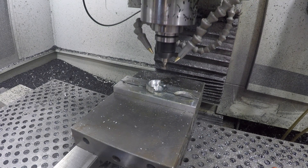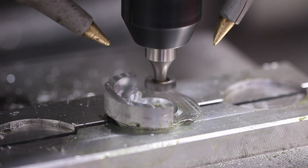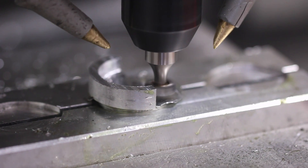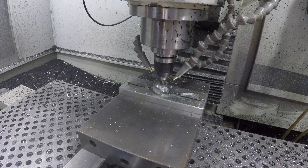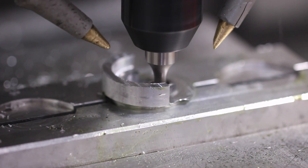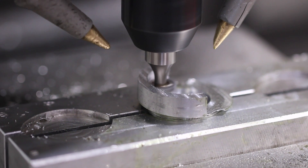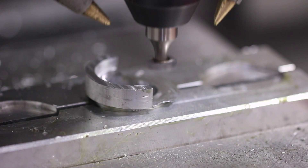Last but not least, the Woodruff groove. There's just always something nerve-wracking about undercutting — no matter how much you do your homework and test it and prep and do gentle lead-ins and widths of cut, undercutting is just nerve-wracking. I used to do a lot of it on another job and we would try to buy staggered tooth to help clear your chips, because that's the real enemy. This looks good, it sounds good — you can see the chips are evacuating, which is great.